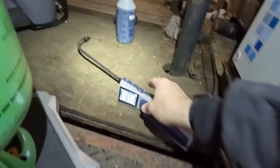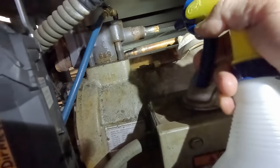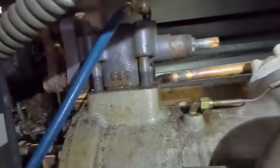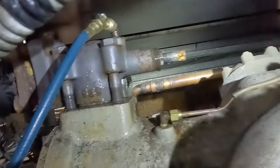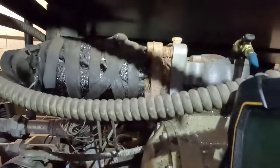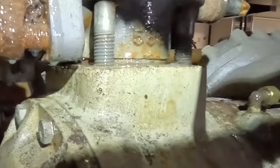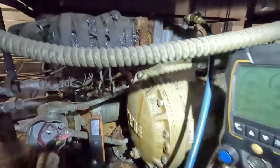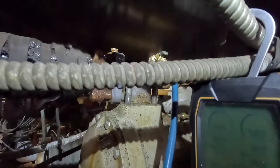At four-thousand PPM let's go ahead and squirt it with bubble solution — it'd probably blow it right off. My hope is I can just tighten the bolts up, we'll see. Not sure if we're leaking on that service valve — does not appear to be. Unless we're leaking on all this garbage back here. I just re-scanned it and it does appear that we have bubbles forming right here — micro-bubbles. It's such a big area all the way around that it's likely distributing all the way around. I'm going to grab a wrench.